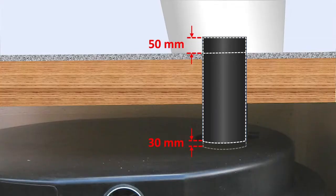The correct length of the plastic sewage pipe between the seat and the composter is obtained by measuring the distance between the composter cover and the surface of the toilet floor. Add 80 mm to the length and cut the pipe from there.